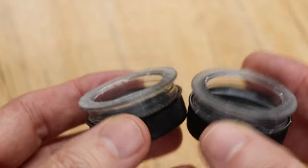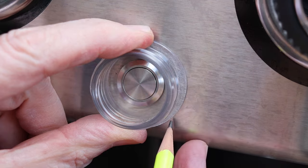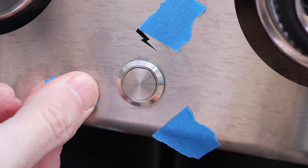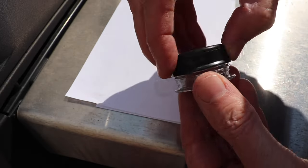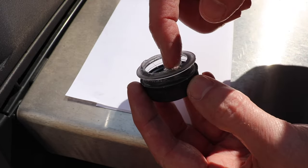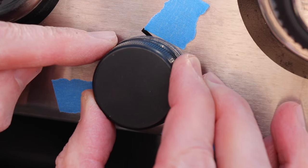Then I gave them a quick rinse to get the plastic dust off. Now just place it over the button and eyeball it to get it centered. Take a pencil and mark it at three spots, then add some small pieces of tape. Now we'll apply a small amount of all-purpose silicone. It's best to have the lid on at this point. Use your finger and apply a small amount all the way around the inside of the circle. Line it up with your tape and give it a gentle push downwards to squeeze the silicone down.